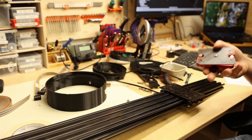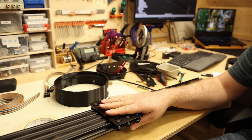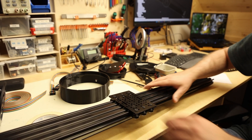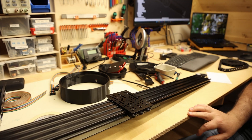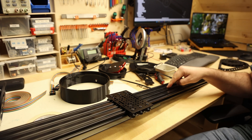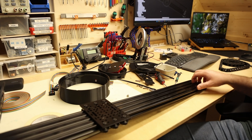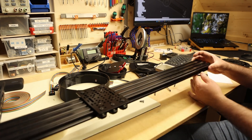For my other experiments, I've fiddled around with this V-slot rail and I'm pretty happy with the quality. It's very rigid — you can't really bend it. It's somewhat cheap, and if you get a local supplier you can get these up to two meters, which is crazy. And there are even little extension rods you can put in here, so you can go as long as you want.